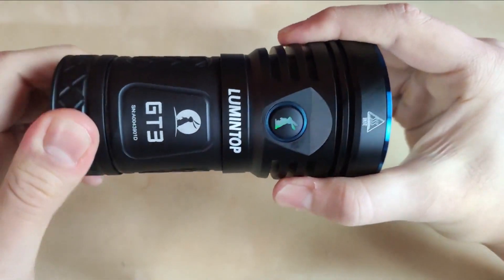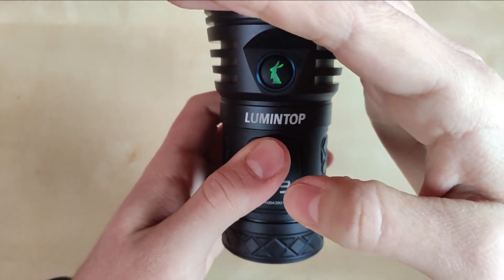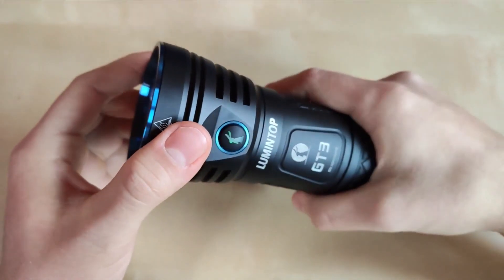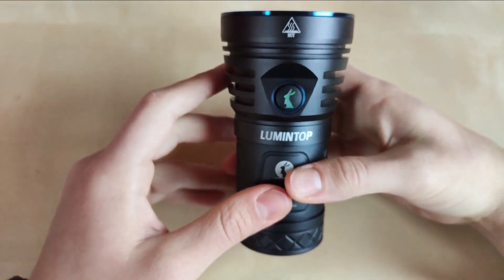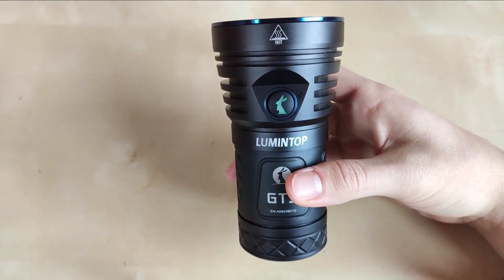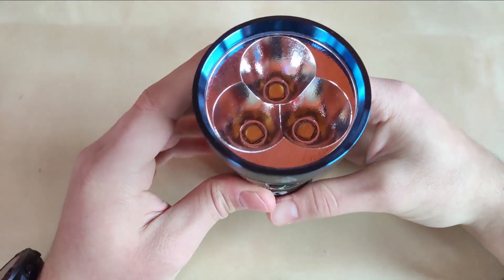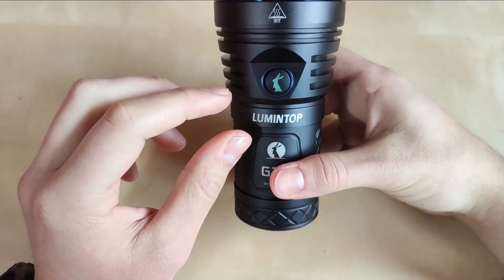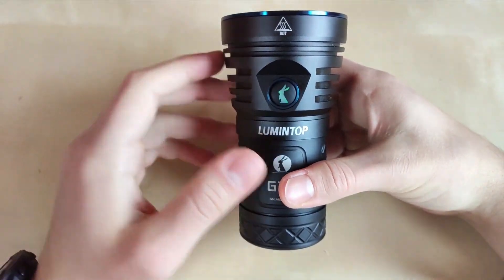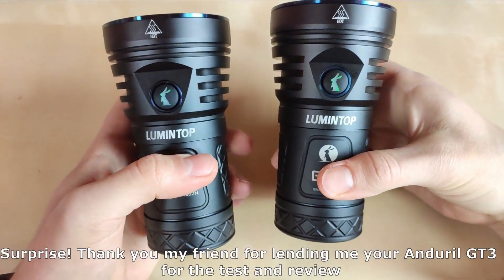Waiting for a blink and we're good to go. As you can see the rabbit started to glow — very nice sign, I like it already. It uses the Texas Ace driver, Texas Avenger, very well known in the enthusiast community on the forums. Very nice driver without perfect stabilization, but who cares if it can deliver over 18,000 lumens from three XHP 70.2 LEDs? The driver is definitely designed for top performance rather than stabilization.